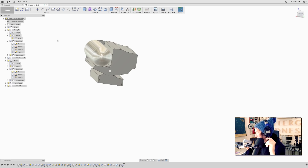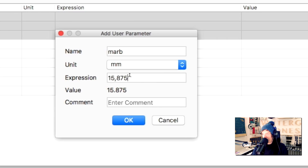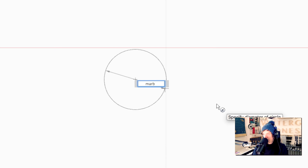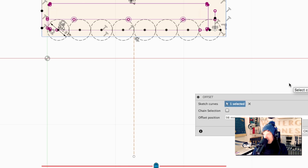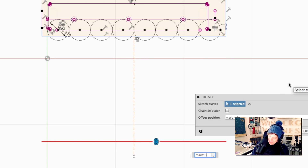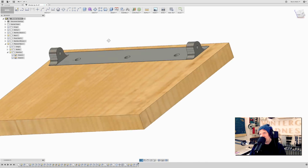Let's make the plywood base. I keep putting in the same value, 15.875, all the time. I'm going to set up user parameters — I'll call it 'marb' and set it to 15.875. Now we can already use the parameter. This is the edge of the swing seen from above; I want to offset that by the distance of five marbles, so instead of putting a number in, I'm putting marb times five. So we can multiply the word 'marbles' — of course we love that.